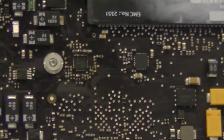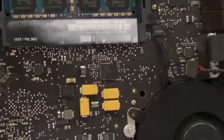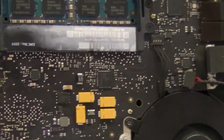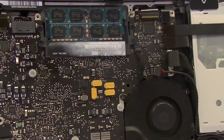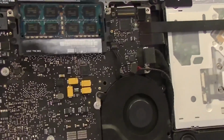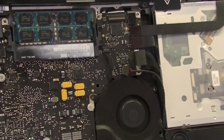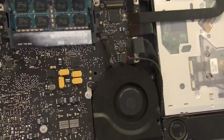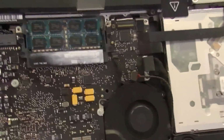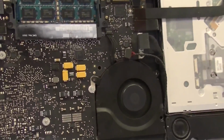Well, what's the point of knowing what chip controls the charging if there are many different reasons that it could not be working? Now, for example, if somebody comes in and says their screen is cracked, okay, I have to replace the screen. But if somebody comes in and says my computer is slow, well, it could be slow because their home internet sucks. It could be slow because they have a virus. It could be slow because their drive is dying. It could be slow because their fan died, and the machine is running really hot and throttling itself. There are many different reasons, so I can't really help you without having an idea of what's going on.